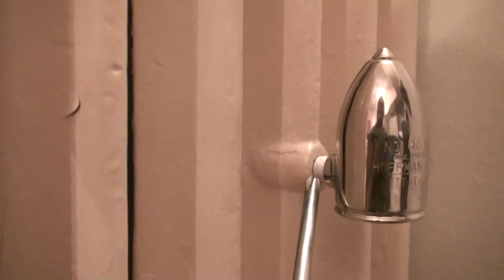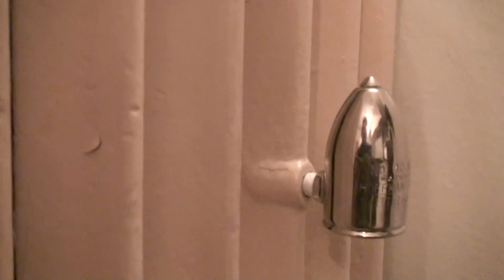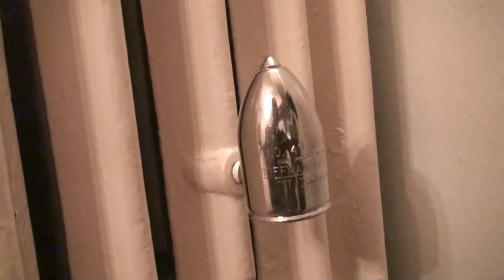Don't get it fooled, because there's an air valve on here and you can actually hear it working well. But this air vent wasn't even here, or the opening wasn't even available when I first purchased the radiator. It was pretty much a plug inside of there, and I managed to twist it out with a pair of vice grips or pliers. As I mentioned in one of the previous videos, you can hear how this radiator is just venting out properly, or this Hoffman valve is giving off that mild hissing that I was talking about. And this is pretty much how you want your radiator to work.